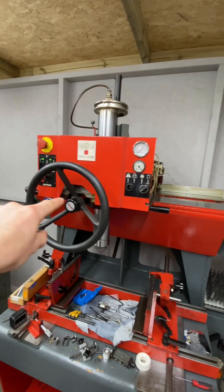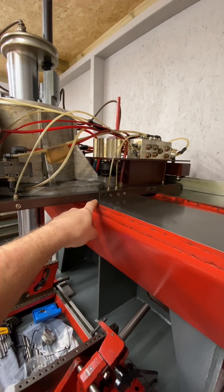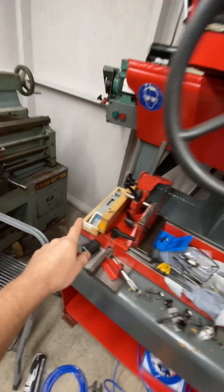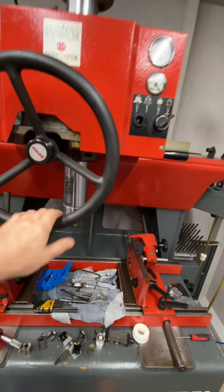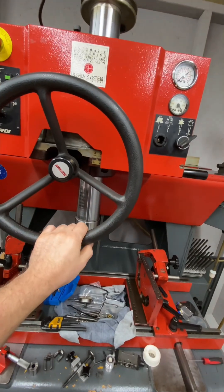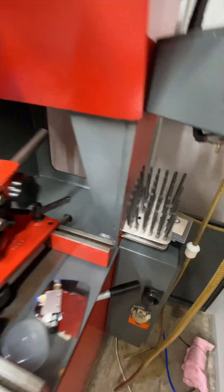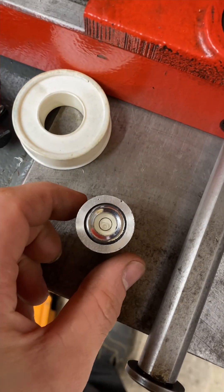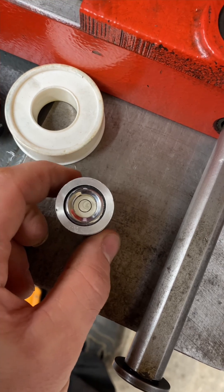Interestingly, this is bowed — the whole thing is bowed. Admittedly it's like a thou, I think. When I last guesstimated it was about a thou in the middle, so it's not a lot obviously over the plane, but it shows up a lot on this because that's obviously very accurate. There are a lot of little caveats with this thing about balancing all of this out so you get nice concentricity. I've had a look online and a lot of people are struggling with concentricity — it's just a machine setup issue. I've now got all the tooling cleaned, so all the pilots and everything.